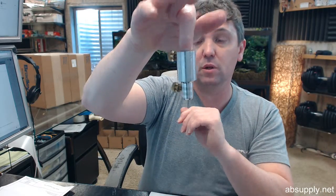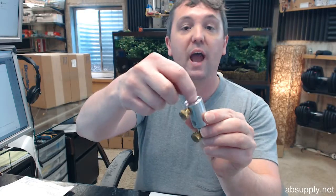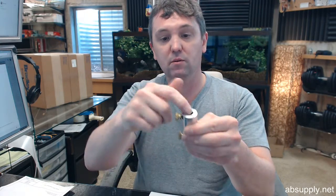The diameter of the unit that's required for that top pin from the pivot is 0.5, half of an inch. If your top pivot is half of an inch, you'll be able to use this quick spotting tool. Rixson, to my knowledge, is the only company that makes this tool. Quite frankly, if you are using pivots by another manufacturer, Rixson got the tool to help you do your installation. Half of an inch is the dimension of your pin that you'll need to get that in there.